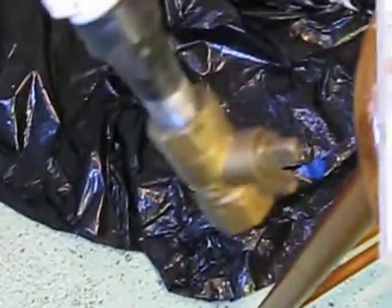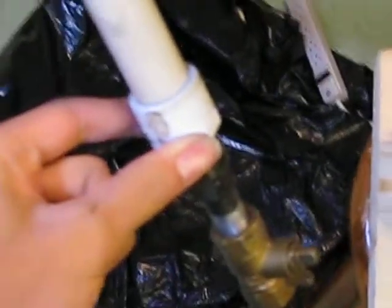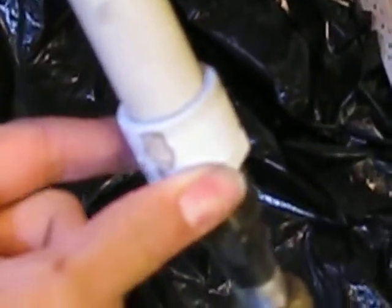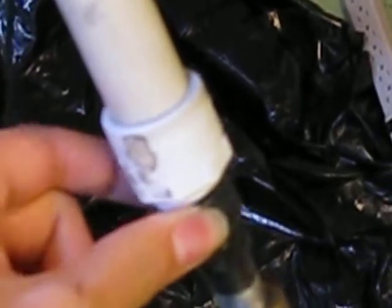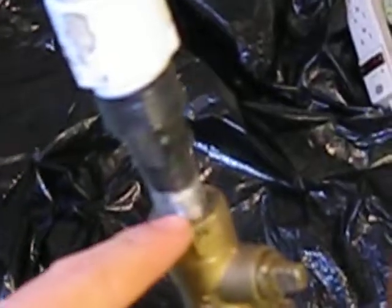So you can open it and close it, not just for the air compressor. I didn't have a half inch bushing, which you would want instead. You'd want to go from non-threaded to threaded with a half inch to 3/4 bushing to put the nipple onto. I just taped that on — it's not very strong.